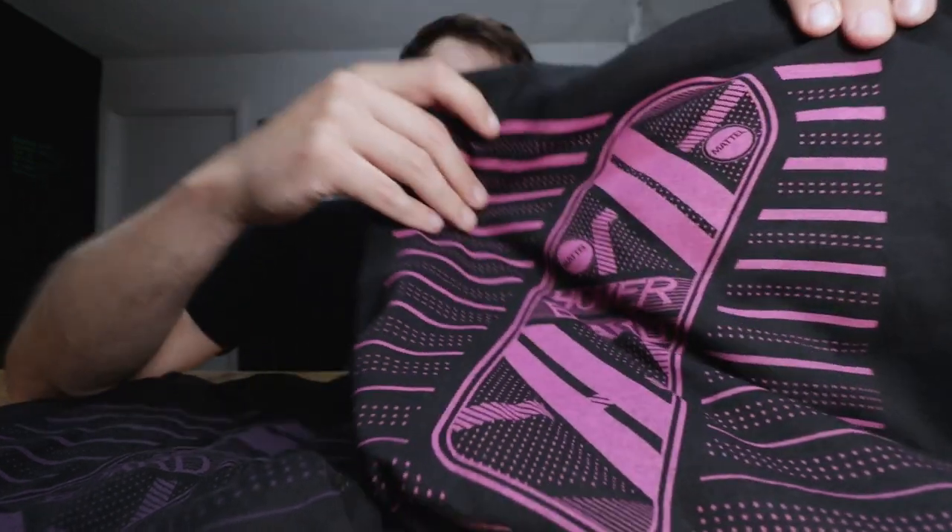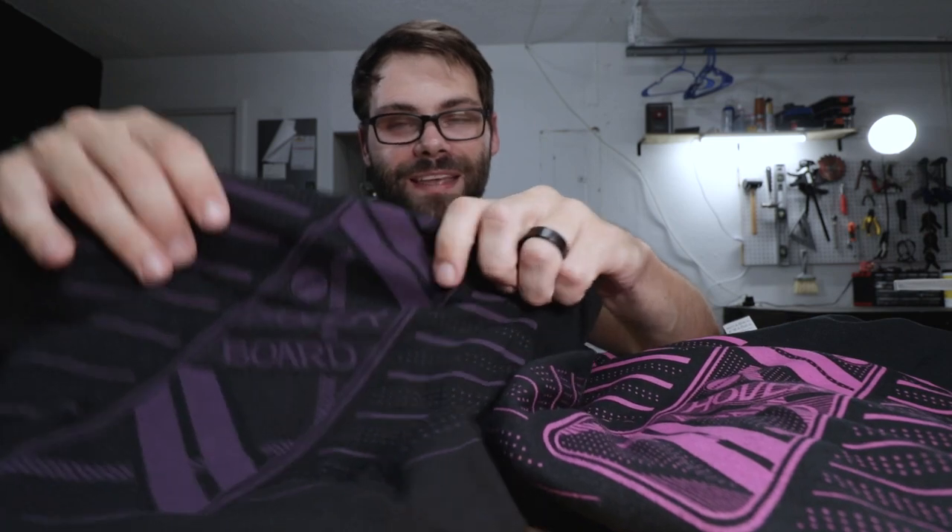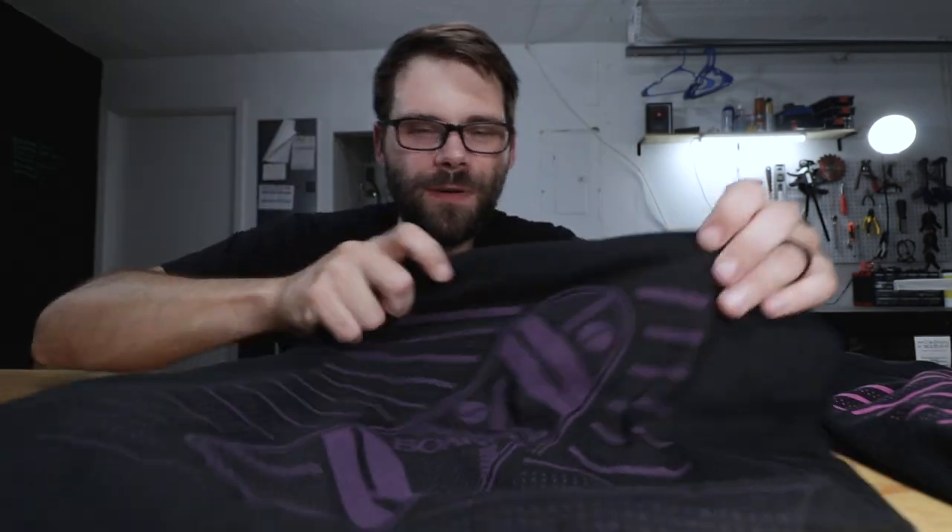When we look at the print on a black garment, we really start to see even more of a difference. The straight Plastisol print — you can feel the ink on top, it's a good print, but definitely not soft. The soft base mix is very soft, but you can almost barely see it, and it's changed the color from a bright pink to more of a purple. I'm honestly not that mad about it — it gives it more of a vintage feel. You kind of have to make that decision: do you want your graphic to be bright, or do you want a soft hand feel? In conclusion, I'd stick to doing this on lighter garments like white or light blue, and leave dark garments for a discharge print.